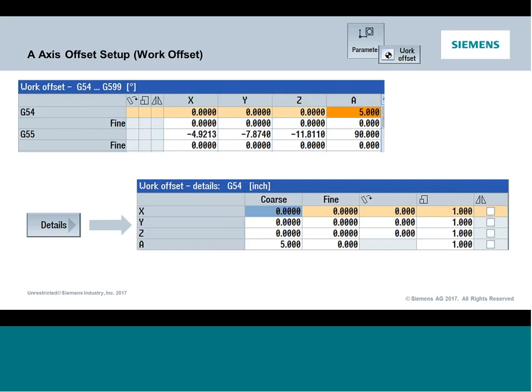So how is this going to work? How are we going to start to set up our offsets? Well, the offsets are going to be set up similar to the way I would traditionally set them up in a 3-axis machine, but now I do have a rotary axis that I can offset or adjust the 0 point. So in a scenario where I'm working on a part, it's clamped in my A-axis rotary, held by a center, and maybe I have to align it to a feature and set my 0 on some feature that was previously done on the part. Now I can offset an angular value in the A-axis field. You'll see an A-axis field will pop up under the work coordinate field, and that allows me to adjust the offset angularly.